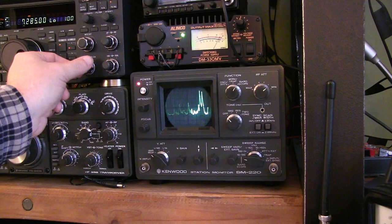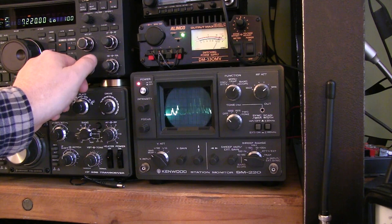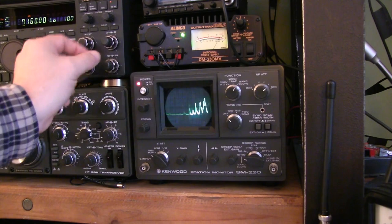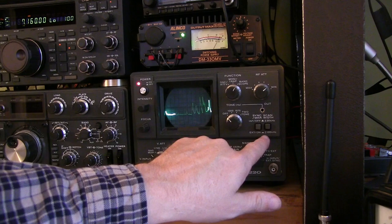There are a couple of strong signals over here. That's actually a shortwave broadcast signal at 7.36 MHz. Working our way back, we could listen to potentially some single sideband signals across the band. That signal right there is at 7.160. You can adjust the frequency span that the pan adapter is looking at in two steps: plus or minus 20 kilohertz around the center frequency, or plus or minus 100 kilohertz around the center frequency.